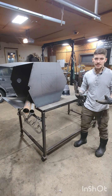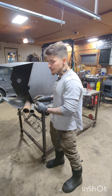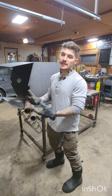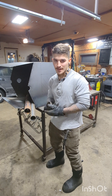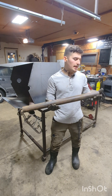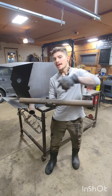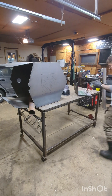I'm just about to seal this thing up. I've got the top tacked up and I'm just about to seal up the bottom, but what I want to do now is put in the ash pipe and the inline blowing fan. You can wait until the end to do this, but it's going to limit the amount of weld you can actually get on this pipe, so the simplest way is to do it now. At this point, the ash pipe should just be the plain two-inch schedule 10 pipe. What I'm going to do now is cut the back angle in, put it into position, and then make the half cut — details on page 8 of 12.